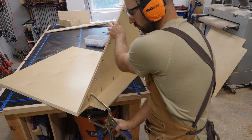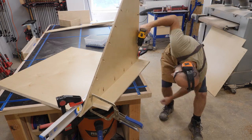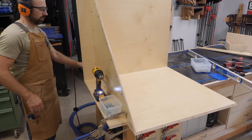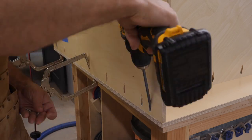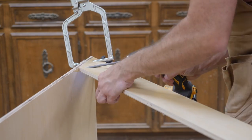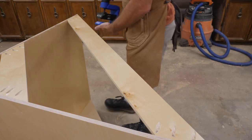Now I'm going to assemble the base cabinet. Since half inch plywood is a bit easier to bend I clamp a level on the opposite side of the cabinet base to keep the piece straight while I run in the screws. To secure the opposite side of the cabinet I can't use the level to keep the base straight, so I grab another pocket hole clamp and go to town running in the screws. I then secure the two side pieces to each other in the back corner. At this point I install the stretchers in the top of the cabinet — the cabinet will be much less flimsy once the face frame has been attached and once it's attached to the wall.